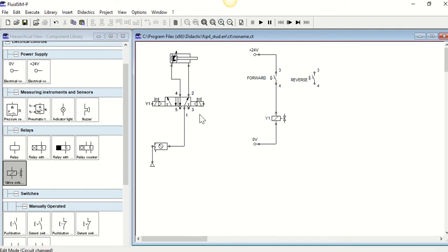You'll see there's no actual physical wiring going across here. When you go to wire this up in real terms with the didactic boards, you'll have plumbed all this up pneumatically. Then when it comes to doing it electrically, you'll be going down through your switch and into your solenoid. You obviously won't have two things here. This is the exact same as that solenoid over there, but in the diagrams you need to have them separated and only connected through the labeling system, because the simulation software wouldn't be able to work otherwise, as this is all airlines and these are all electrical wiring. Hopefully that makes sense. I do recommend watching some of the electropneumatic videos I have of me on the board wiring up some of this stuff.